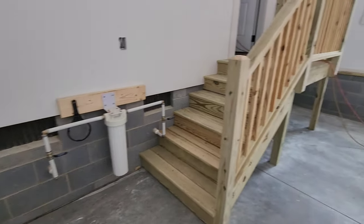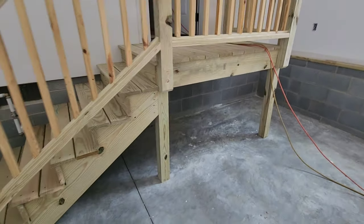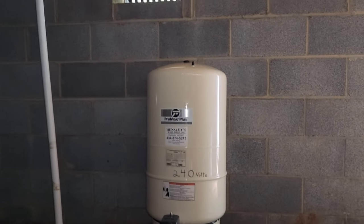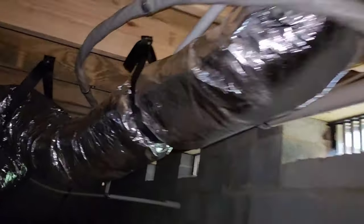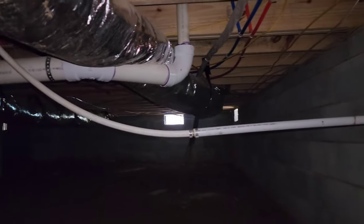Now I have to go and redo all this just to move the filter right here — that's where he wants it. I hate it when you do a good job and then you've got to undo it all. Over here, under the house, this was my tank setup. You come out of the ground, you've got your tank, then it goes up with one-inch PEX. You follow the one-inch PEX all the way down, going in the wall there and coming out the wall there, hooking up to their three-quarter inch line. Now I've got to redo all this and drill new holes.